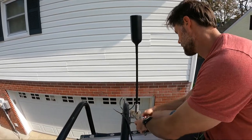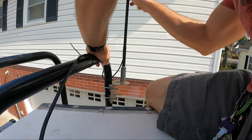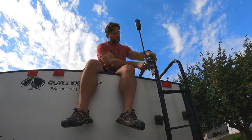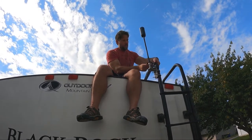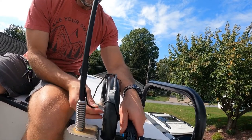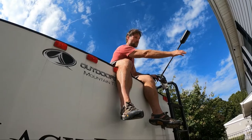Reverse it and tighten it. Technically we're done. I'm going to get some electrical tape and tape right here so that there's plenty of articulation. I am wrapping black electrical tape around the cable that feeds into the side terminal on the mast, and I'm taping it to the ladder. But I left enough cable — keep this in mind, like I mentioned earlier — to give the articulation that far, that far, in whatever direction you need to go.